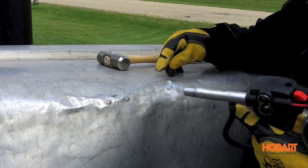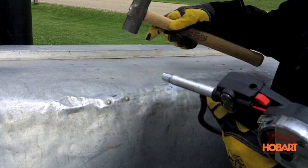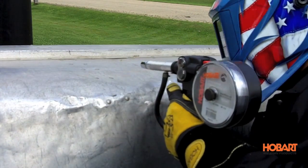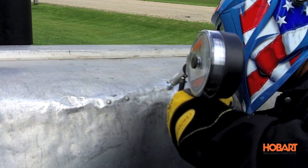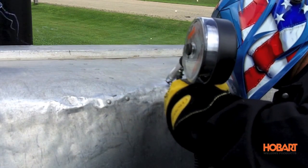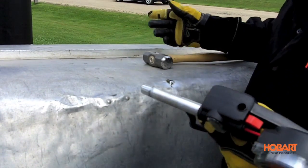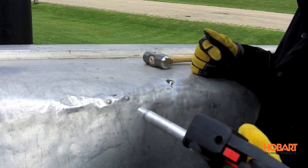This is some pretty thin aluminum here, and with the crack it looks like it was rubbed pretty thin. So I'm going to use a steel hammer kind of as a backing plate and see if that helps just weld this up. Okay, looks like it's welding good. I'll finish it up, we'll grind it down and hopefully it floats.